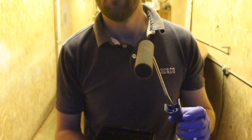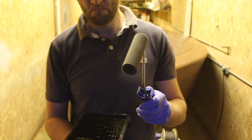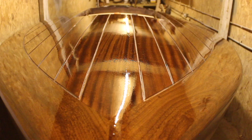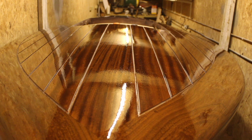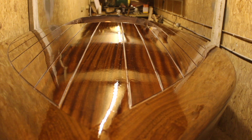I'm trying out a new roller with this one — a superfine gloss roller, so we'll see how that goes. That's coat number seven just starting to flow out. Tomorrow I'll roll another coat straight on top, and the day after that another coat, then leave those to harden before repeating the same process. I won't film those next two coats and I'll pick up after that.